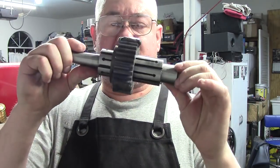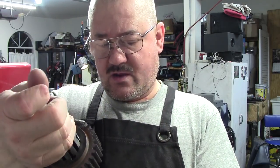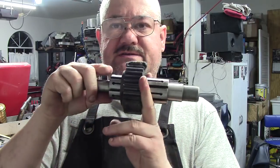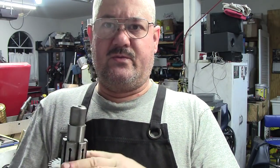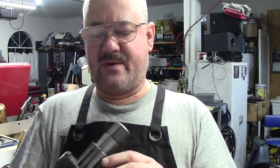There are 31 teeth, but we'll talk about indexing in the other video. We've got our mandrel — mandrels are very handy to have. This one is made by Western Tool Manufacturing Company out of Springfield, Ohio; it goes from one and a quarter to one and a half. The bore on this is, I want to say, one inch 625 thou if I remember right.